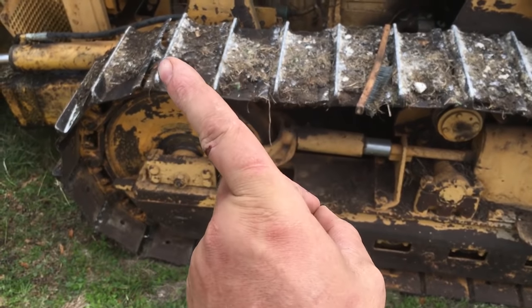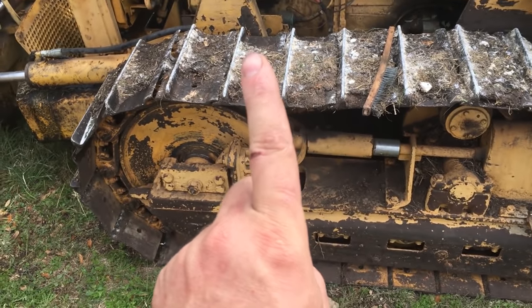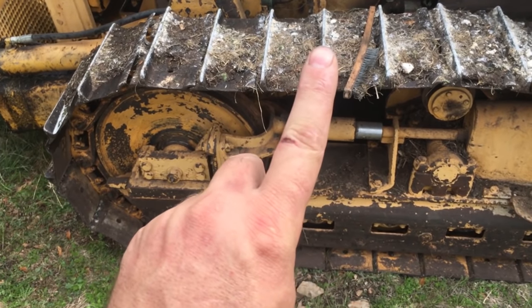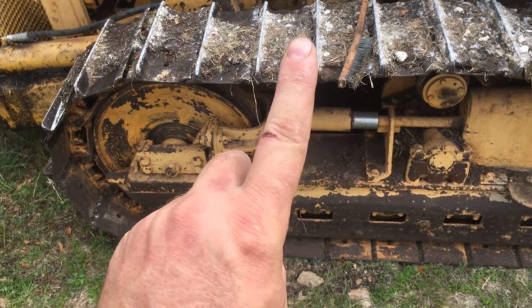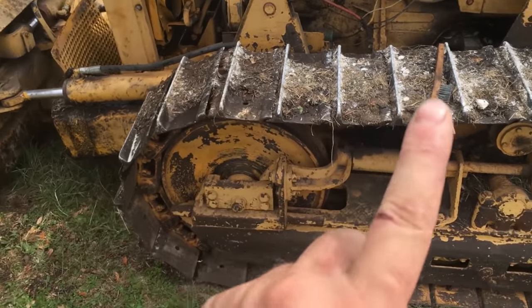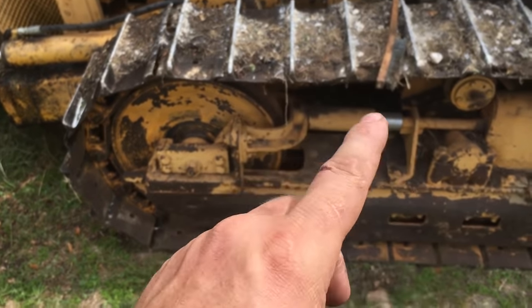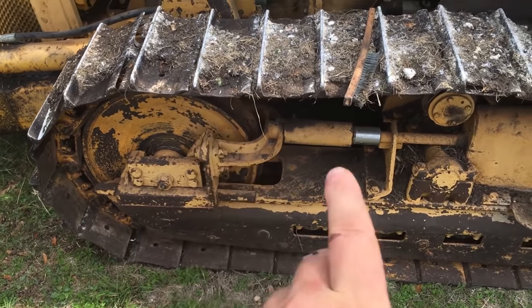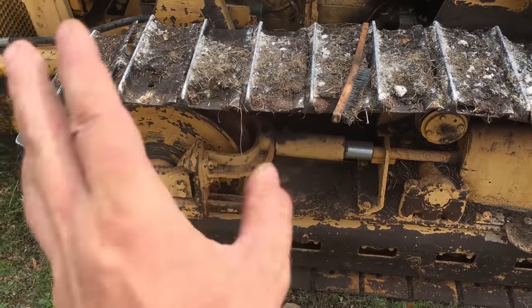So you watch that temp gauge, and a lot of times you'll be running it, like I say, 190, 200. You shut it down, it'll start raising. And if it gets up around 220, you need to increase the RPM a little bit. That speeds up the water pump, speeds up the circulation to the block and the cooling through the radiator. And then once it starts going down, idle it back down until you see it just continually start dropping even in that idle. Once it drops all the way down and bottoms out, then shut the machine off.